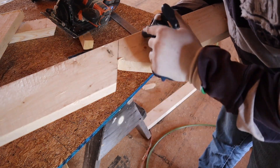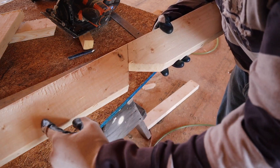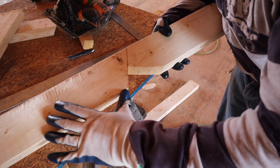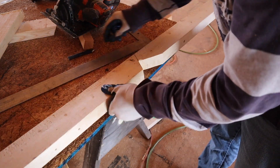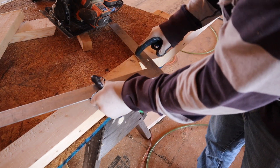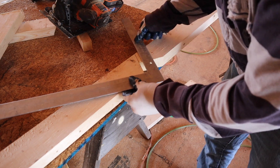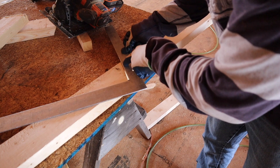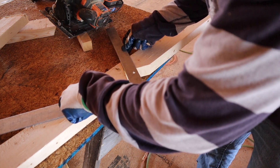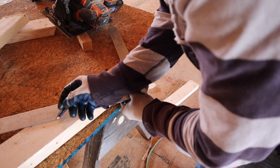Then you've got to decide your overhang. We cut that section out for the bird's mouth and now we want to get from here to over here for our next plumb cut for our overhang — eight and a half inches, so we have a 10-inch overhang. Take your framing square, put it on this mark — that was our plumb cut off the edge of the dormer wall — slide this down the line until we get eight and a half inches on this side, and make a mark.